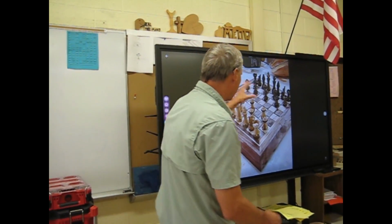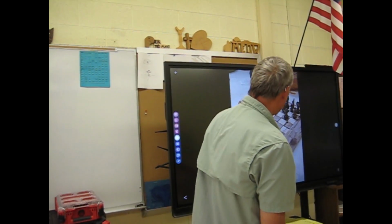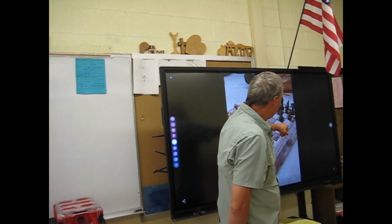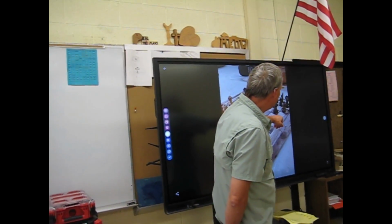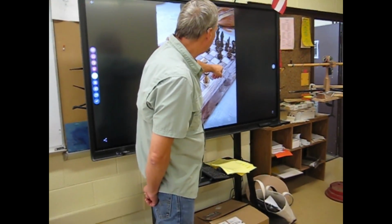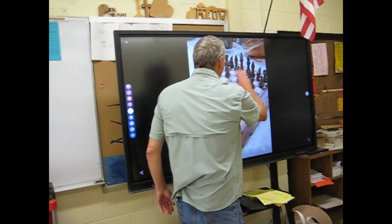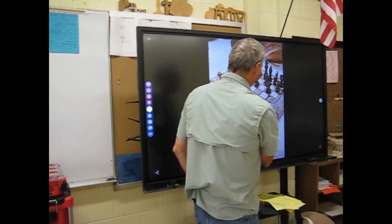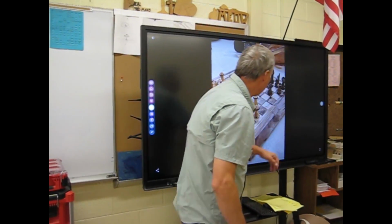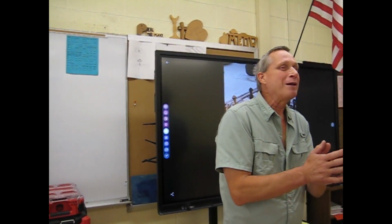I was spraying the rest of everything to soak it down, to raise every grain, and then I'm going to sand it. The pieces are spalted box elder. And then this was black walnut with a lot of wormholes in it. I didn't want them to be identical. I wanted them to be similar, but I want them to have their own look. Now again, it's split in half. And yes, all the pieces do fit when it folds. There's not room for one more piece.